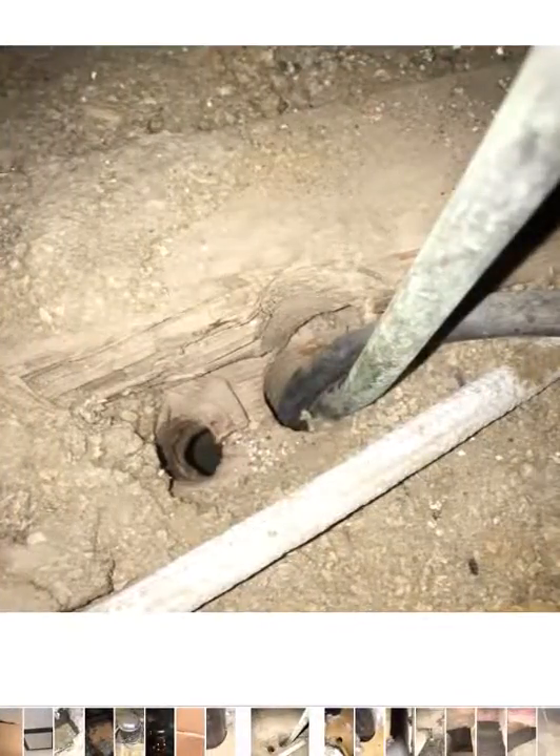There's a wire or a plumbing penetration. Here's a couple more wire penetrations. Wire penetrations. There's a plumbing penetration — see the gap here. Heat travels, guys. Convective heat moves. Insulation doesn't stop it. You see the discolored insulation right here — that's indicative of airflow. Air is moving.